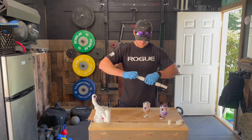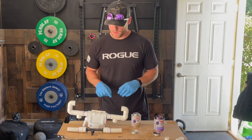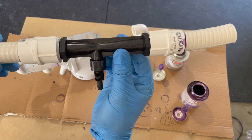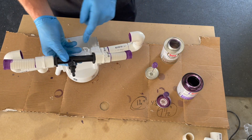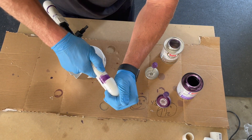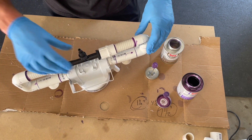The goal is to have flexible PVC coming out of each side of the venturi injector. Despite my two hiccups in assembly, this next part is the most critical thing to get right — the direction of the water flow. Make sure you match the in and the out, and have water flowing the same direction through the filter as through the ozone. Find your flow marker and plan accordingly. After priming and cementing the tubing and fittings, triple and quadruple check that your flow is going the right direction. Insert the tubing into the fitting on one side, then muscle the other side in — it should slide in once in place. Give it a little twist and hold for another 30 seconds.